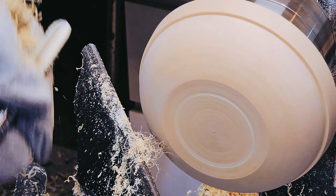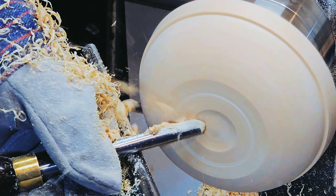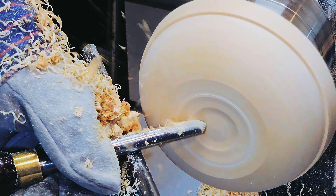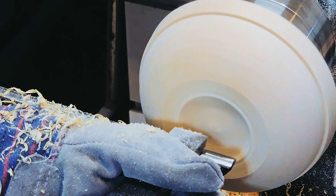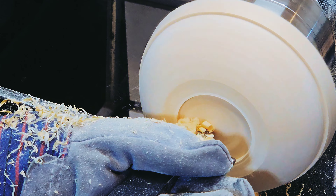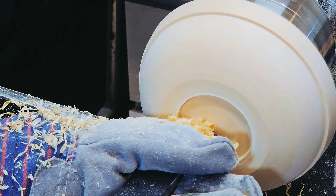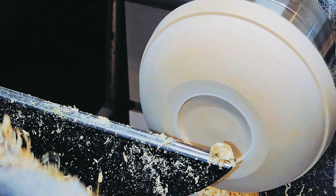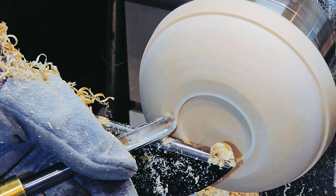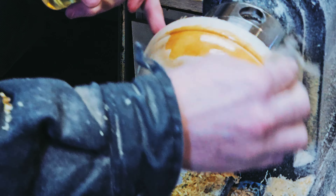For now, on with the making. Until now you've seen me shape the bowl with the half-inch spindle gouge. I'm going to mount this on my four-jaw chuck in a recess. I haven't done a lot of recesses lately, and after doing this one I realize why. The tenon seems to be a lot more user-friendly. You have a lot more options when you've got one, because you cannot add wood, but you can always take it away.